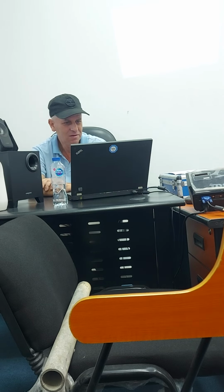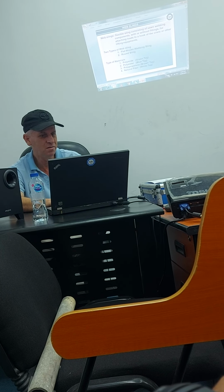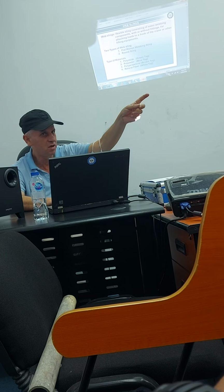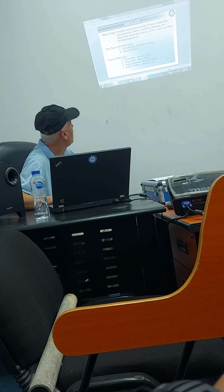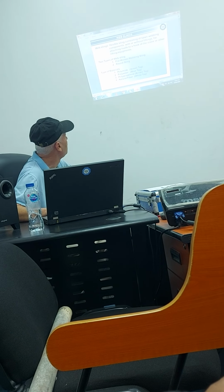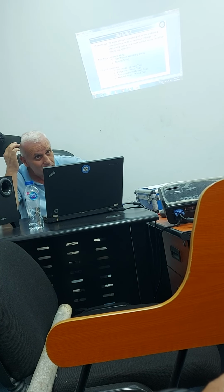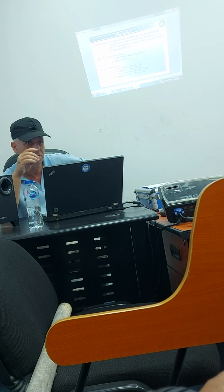You can see the types of material by the tag. A green tag is made of polyamide. A blue tag is made of polyester. A brown tag is polypropylene. A white tag is natural fiber. So we have 2 types of webbing sling, flat woven webbing sling and round sling, but 4 types of material. Natural fiber is like cotton, sisal, manila.